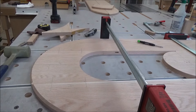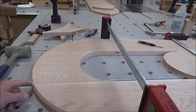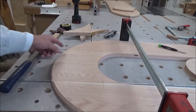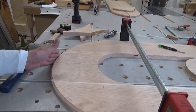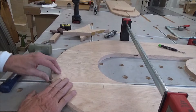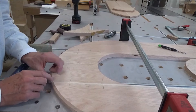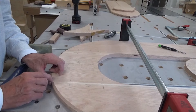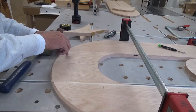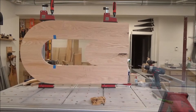One thing I'll point out is that when I was putting the bevel on, I left this area right here — you can see this little knob — because I did not want any blowout. I've got a knob back here as well, and I'll just blend that in with a hand plane and some sandpaper. When I do that, these fibers will be supported by this piece and these will be supported by this piece. I think I'm ready to go.